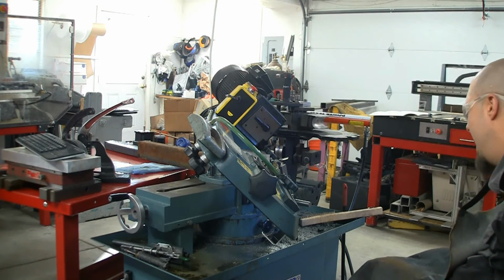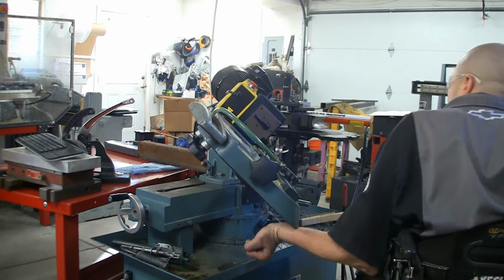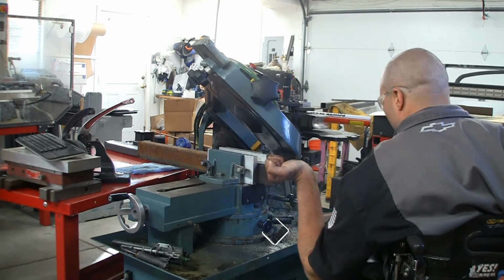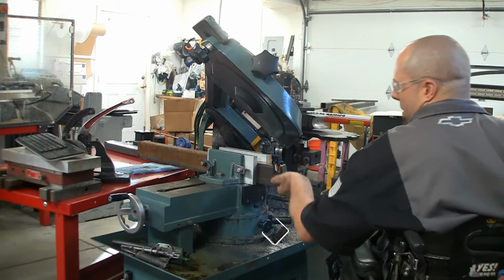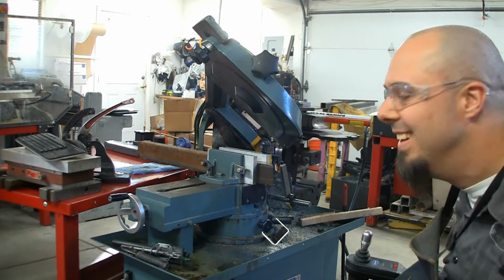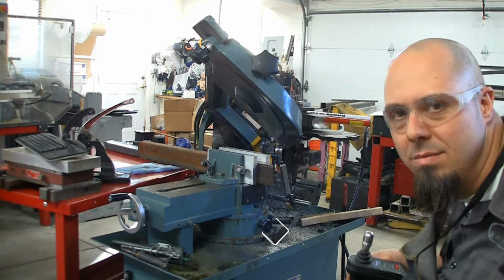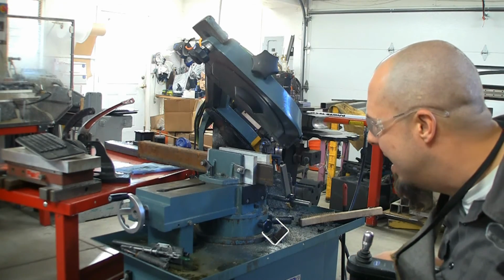And there we go, chamfered cut. Go ahead and put the lock valve back on. I haven't ruled out putting in a block and tackle or a linear actuator or something to lift this damn thing, but there you go. Nice 45-degree chamfer. Miter, I guess, is what you call them when you're doing this, not doing machining, but got a miter on there. Going to flip it, miter the other side. I've got to put together a total of 4 of these, and a total of 8 of these for 2 sides for a stand, and then weld them up.